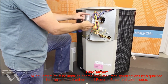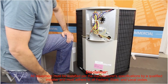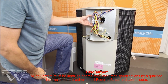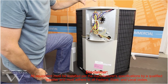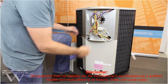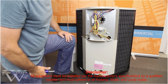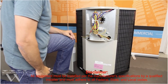This part that resembles a soda can is the capacitor. One thing to note is that it's flat on the top and bottom. When the capacitor fails, the top might become bubbled — if you see a bubble it's an easy way to diagnose a bad capacitor. If after several years of use your fan, compressor, or both don't run but you know you're getting the call for cooling and 24 volts to the outdoor unit, shut off the main power, take off the access panel, and check your capacitor to see if it bubbled up. Replacement is very easy and the connections are labeled at the top of the capacitor. This can save you a lot of time and money compared to a service call for something fairly easy to replace yourself.